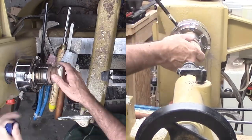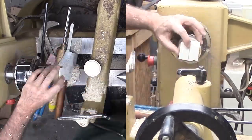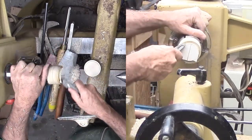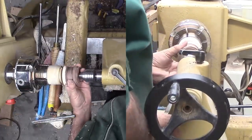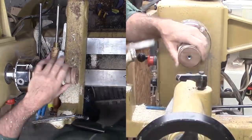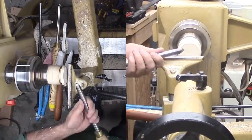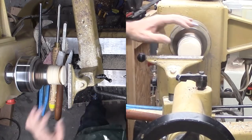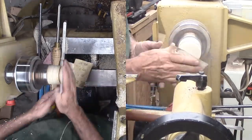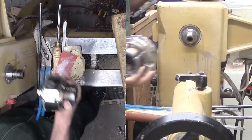Once it fits, I'm mounting another work platform to my chuck and again applying double stick tape. Then, to transfer the medallion as concentric as possible, I'm pressing the first work platform while aligning it with the live center pressing into the mounting nut of the work platform. It gets me close but not perfectly. After this, I can level the surface of the medallion and sand it for the background. This is easy now but would be difficult later after I cut the features.